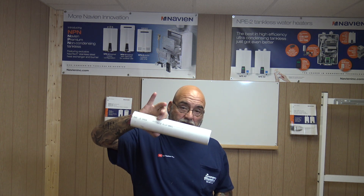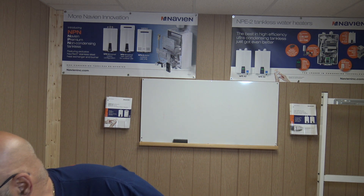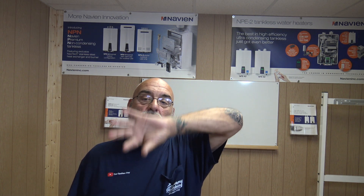Now this PVC is from Home Depot — it's black letter because they only sell the black letter — but it's schedule 40 pressure. At a plumbing supply you're going to get red letter, that's also schedule 40 pressure. You're going to use pressure-rated pipe because the other stuff is called foam core, and condensate will eat through the foam core. The fittings you can use drainage, like a short-turn elbow — I prefer that — because a short-turn drainage elbow has a better radius than a pressure elbow. You don't need to use long-turn, it's just a waste.